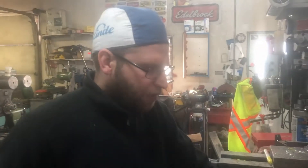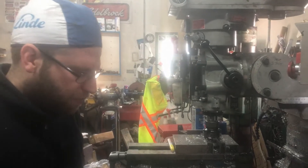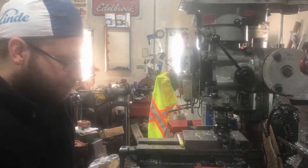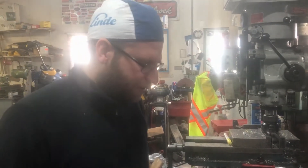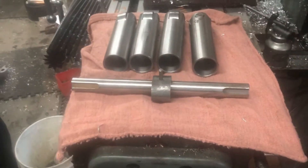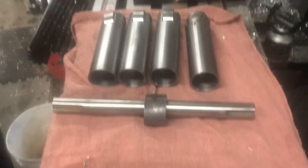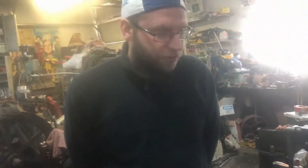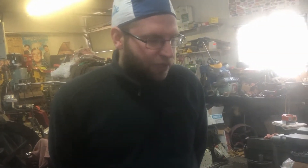We got the four rollers for the Rumley done and the one roller for the little Eclipse hit-and-miss engine done. We hardness tested every one — they're all right around 50 to 52, which is to be expected. The Rumley rollers were worn out very badly; the tractor is off a 1919 Rumley 1630. The little Eclipse would be probably late teens and had done a fair amount of water pumping. The originals were probably just mild steel case hardened — referred to in the parts books as open hearth steel case hardened. The actual steel was tough to say, but ours was 8620 and we case hardened it.